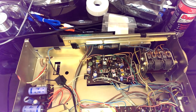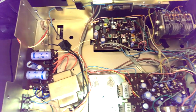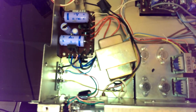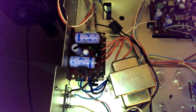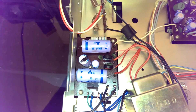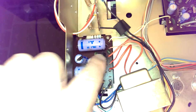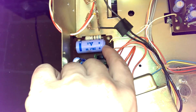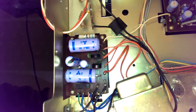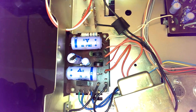The front panel is held on with a multitude of screws. On to the circuitry — you have your power transformer there. You have a rectification and filtering board; nothing fancy going on here at all. It does need to be recapped. These seals have gotten hard and you can see they're starting to bulge on the end. That's bad for long-term reliability. If those fail, it could take out the power supply and ruin the unit.